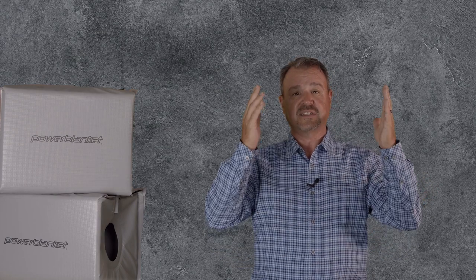Immersion heaters can be put into vessels that heat anhydrous or aqueous ammonia for NOx control systems. So the pollution control systems in any plant that emits nitrous oxide is actually being controlled by an electric heater that vaporizes ammonia in process.